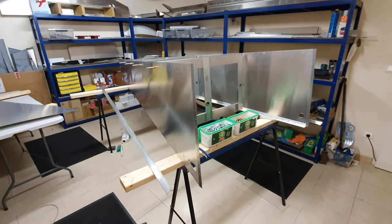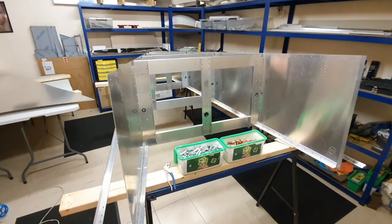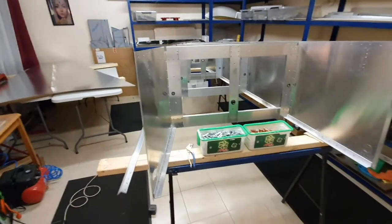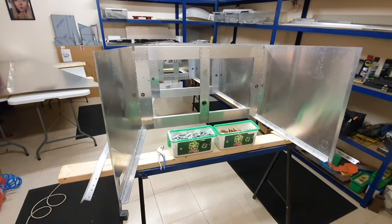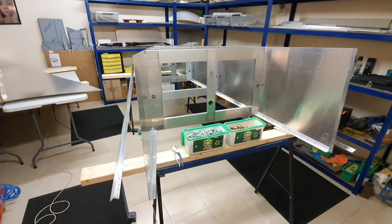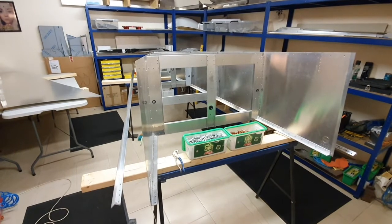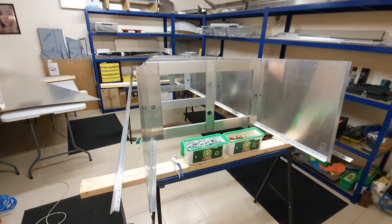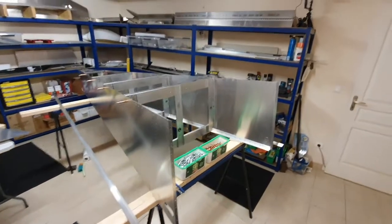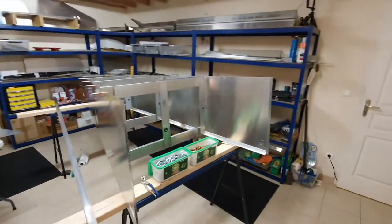To start off with I'm going to be reinstalling the top longerons back onto the tail cone, then I'm going to flip it over the other way and put the bottom on. The reason for that is I want to get it absolutely checked for squareness and level, making sure every last bit fits properly as we go. I need the bottom in place to get everything absolutely square, and once I've riveted the other parts together I can take the bottom off and it shouldn't move - that's the theory anyway.